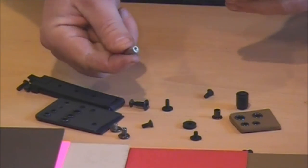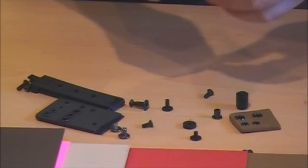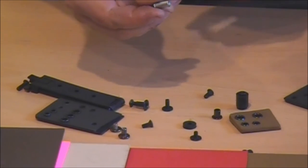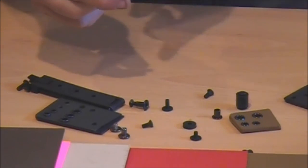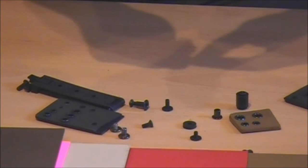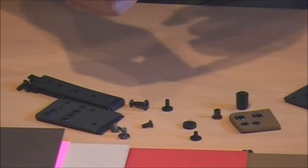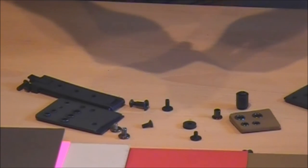Even considering if we want to make something special, this is a 1/4 inch pivot pin which takes an 8-32 thread, putting a head on the bolt. We can now slide that through a standard 1/4 inch hole and bolt it up, and again, being quite thick, we can use this to bolt in lots of different layers and lots of different accessories if we wish to, or we can grind it back to whatever thickness we want, or even put a standard blade tech screw in the other end. The blade tech screws, to be honest, are the nicest in the general stuff because they're countersunk and they have a slight dome head on them. You can use standard countersunk ones, but they don't sit quite as nicely.